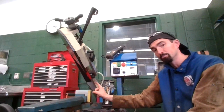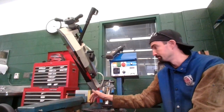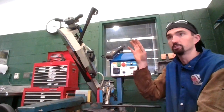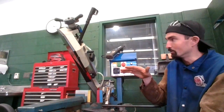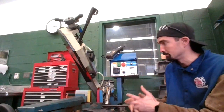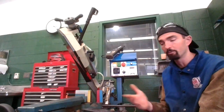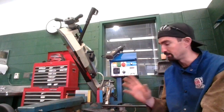So as I'm looking at this bandsaw right now, it has a bunch of teeth. The teeth are what do the cutting. If the teeth start getting broke off, we'll hear, as it's cutting, it'll go kunk, kunk. That kunk part is a void of teeth, and it's not cutting. That's very expensive. So each blade here is $67 or more. So it's very important that we do things correctly so that way we don't destroy the blade and don't do more damage to the entire machine.